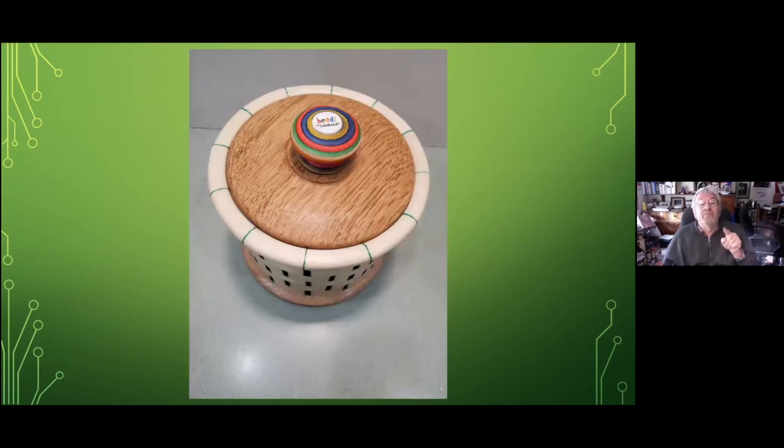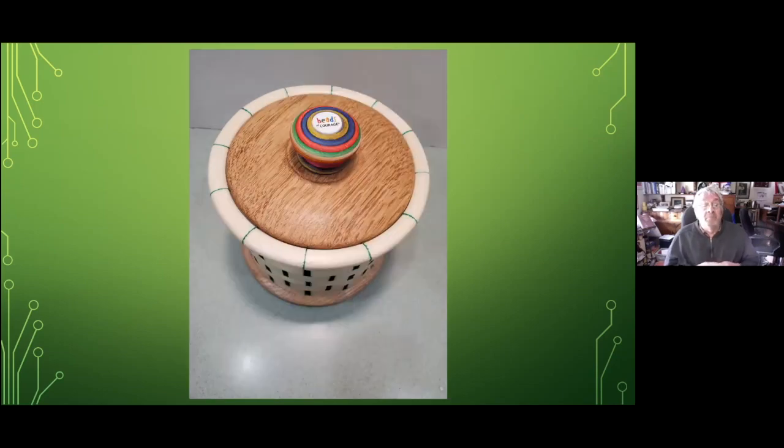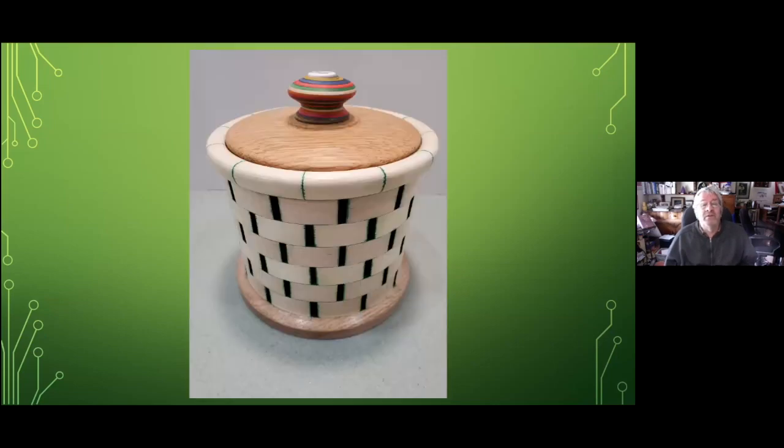The beads of courage, white thing, beads of courage, a 13/16 spade bit or Forstner bit makes a hole that you can press the bead into. It works really nice. And people have asked me, well, what are you thinking, man? The beads are going to fall out through those holes. And I'm thinking that Beads of Courage probably wants beads small enough that a kid can stuff up their nose or in their ear, or worse, become a choking hazard. So the spaces are 3/16. And I can't imagine a bead that small being given to a kid because of the risks.